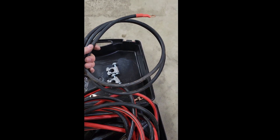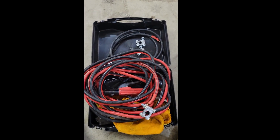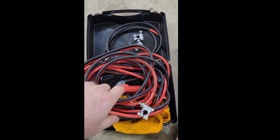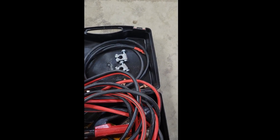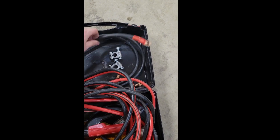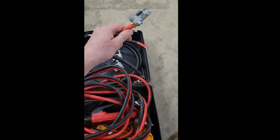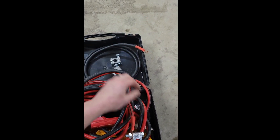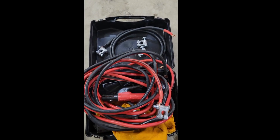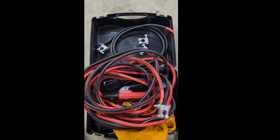This is your jumper piece — it goes from one battery to the other. When you're welding on the trail you're going to need more than one battery, at least 24 volts; sometimes three batteries works even better, but this one's only set up for two. You hook this from the negative post on one battery to the positive post on the other battery, then this to the empty positive post and this to the empty negative post on the opposite battery. That runs the batteries in series and gets you 24 volts.